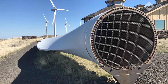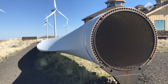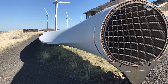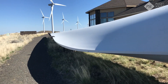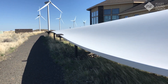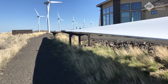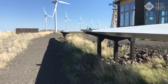At Wild Horse we use Vestas V80 wind turbines, which have an 80 meter diameter wingspan. Each individual blade is 39 meters — not counting the hub — which is 128 feet long. These blades weigh 14,000 pounds and are made up of three pieces: two outer shells that give the blade its shape, and an inner spar that strengthens the blade. The edge we're walking along now is called the trailing edge, and it's quite tapered and sharp — that's why we call these blades.